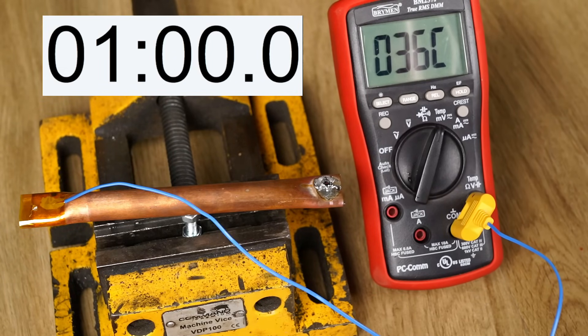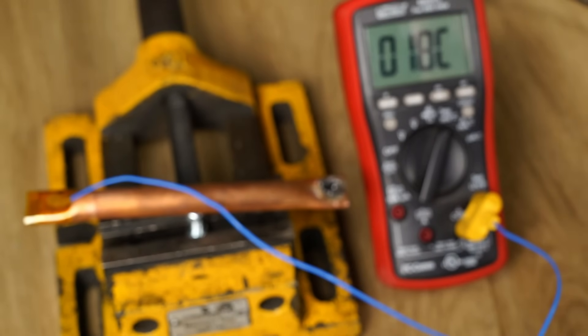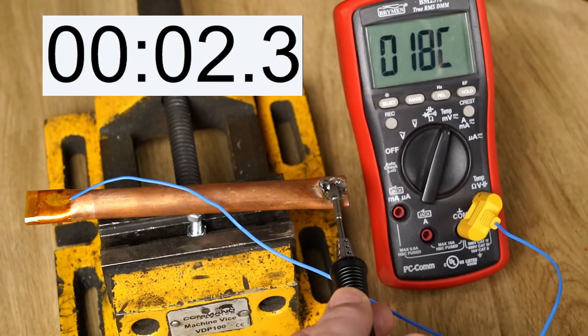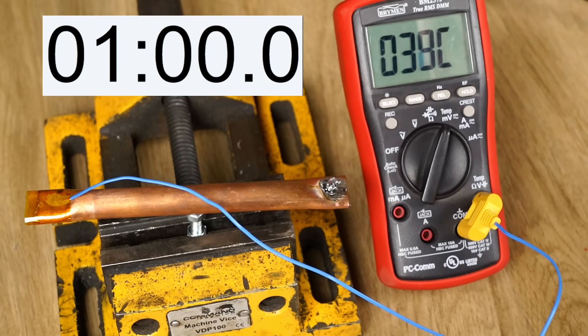To establish a baseline I started with an older style iron — before the time of modern direct heat iron tips such as the JBC or T3A. These irons were the bees knees, however this style has a much slower response time compared to more modern irons. After 60 seconds the temperature recorded was 35°C. Next I pulled out my Miniware TS80P — a brilliant iron and my most used iron in the workshop. Being a USB-powered iron rated at 30 watts it's definitely going to struggle in this test, and after 60 seconds the temperature recorded was 37°C.